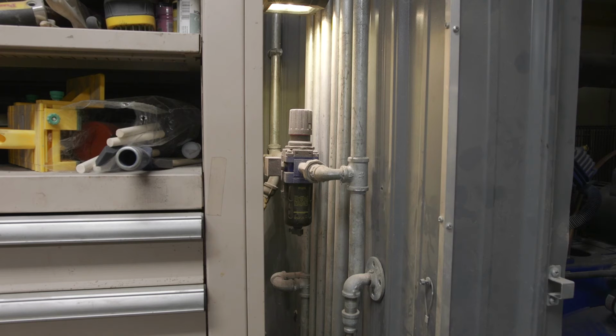So coming out of the compressor, what I do is I cool the air immediately. Then I put it into the tank. Then out of the tank, it comes over here and comes to my manifold. And the manifold has 1, 2, 3, 4, 5, 6 bars. And so once it gets to the 6th bar, it's pretty much moisture free. But at that point, it runs into that regulator that collects any moisture. And then at that point, it runs to the whole shop.